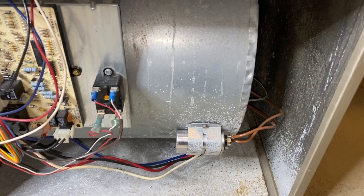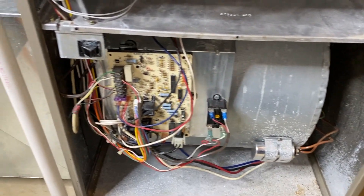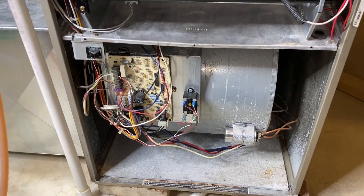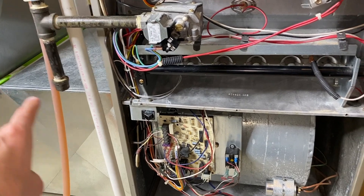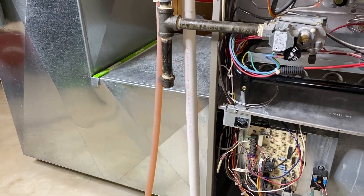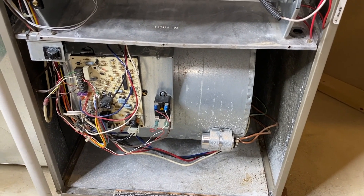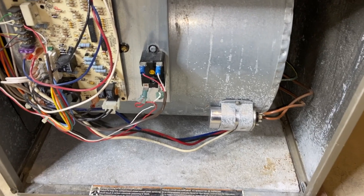Long story short, once that's up and running, it is pulling in all the air from your ductwork. If it's already heavy with debris and ash or dust buildup, it's already working overtime. And when you add that filter, it just might not be able to handle the added blocking of airflow as a filter is designed to do, combined with the added weight of the fan blades. It just won't be strong enough. So when you pull that filter out and open up that entire chamber for air to pass through, your blower motor and fan aren't working as hard — so keep that in mind.